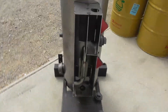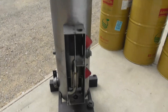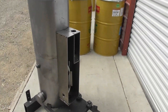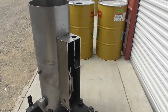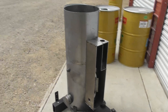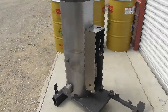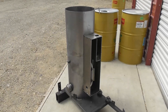That's what the heat exchanger looks like — it's a little tricky, and the assembly drawings go through the steps in more detail. After you're done with this, you're going to leak test it to make sure the gas isn't leaking from any of the outside welds around that box. Once the reactor is done and the heat shield is done, you can add the external insulation layer on. Good luck on your builds and we'll see you on the next one.